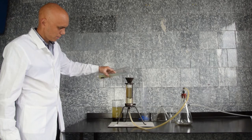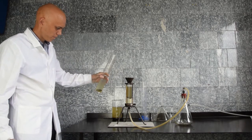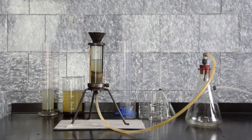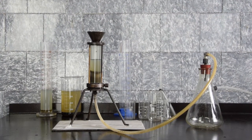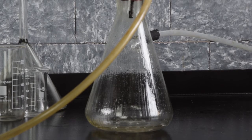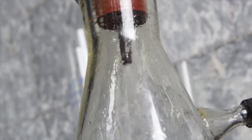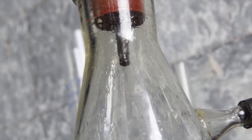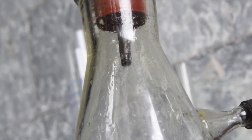The effectiveness of reagent cleaning depends on the intensity of mixing the components into the emulsion. Then the emulsion needs time to separate with precipitation of reagents. We use the vortex layer device AVS150 to amplify this process. It provides intensive mixing of diesel fuel with reagent, despite high temperatures and low concentration of solutions.